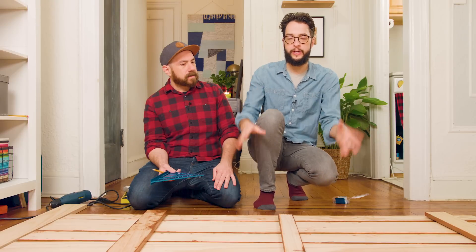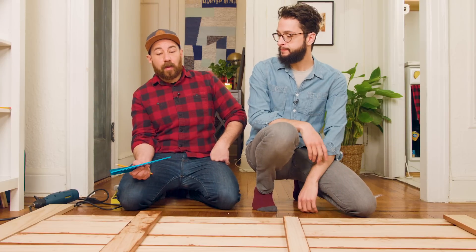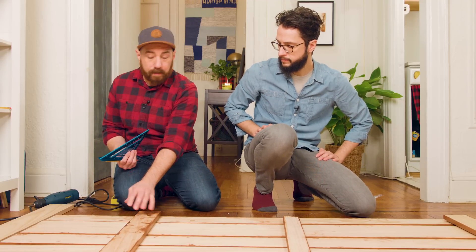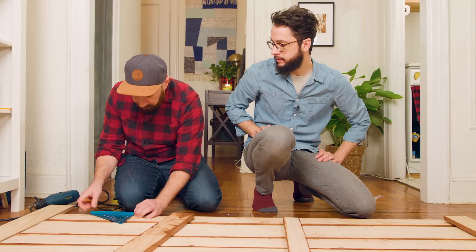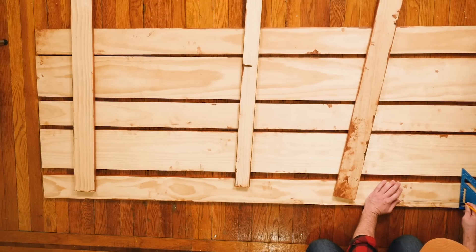Now we're going to put it all together. Our bed frame has holes in it so you can attach a headboard to it. Everything was all measured out already — we knew that we wanted 50 inches for our headboard. So our posts, we just cut down to 49 inches. This way, we can start it an inch down from the top piece. We're using an easy square to measure everything out — we're going to line this up at the one-inch mark.